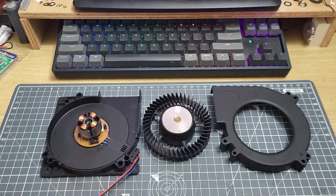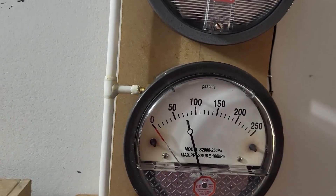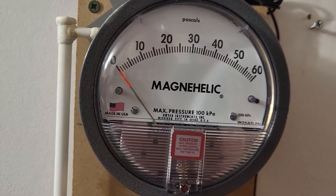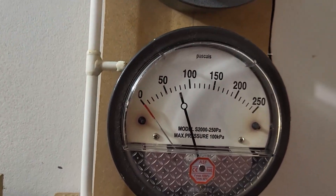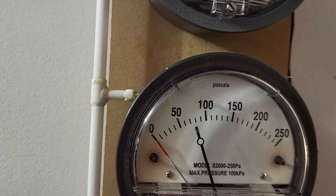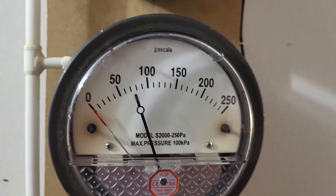Let's have a look, once I get this thing assembled again, at how it performs in the airflow chamber. I've got the blower fan ready to go against the air chamber, and I'm going to show these gauges. By way of explanation, we've been using this high-resolution gauge because of the very weak pressure developed by axial fans — a very different story with this blower fan. We need to go to this gauge now. The first six increments on this gauge are the entirety of the other gauge, so we're not looking at 60 pascals, or 100, 200, or even 250 pascals. This fan is going to blow the needle right into the rubber stopper at the other end.